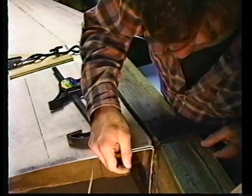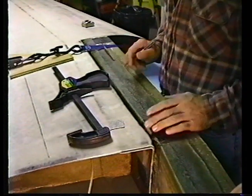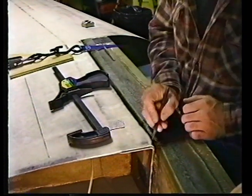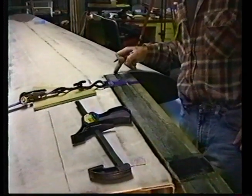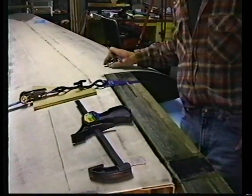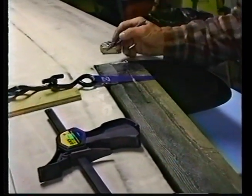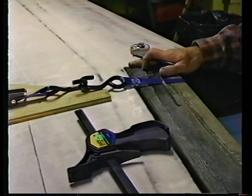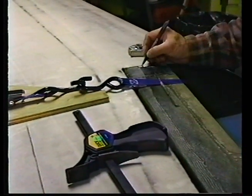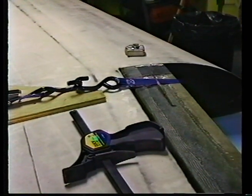Half of his plates are 3 inches wide on the interior, the other half are 2 inches wide on the exterior. You've determined this so that if you see something like this gap here, he's got about 3/16 of an inch here at the top side. And the bottom of his rib is directly against the spar, so it's possible that he trimmed this too much. It can easily be handled when you put the strake in place and you let the flash extend all the way out to the outside, so you cut it to match.